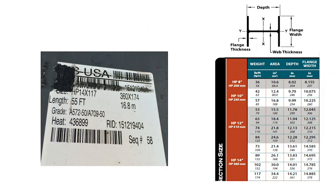The size of the pile is usually marked on the pile by the use of a stamp or a sticker. For an H pile, the first number is approximately the flange width and depth of the pile in inches. The second number is the weight of the pile in pounds per foot. Also, when inspecting the piles, compare the heat number on the CS4171 material certification and the stamp on the piles. The information should match. This heat number will also need to be documented on the CS1005 form.